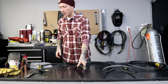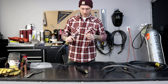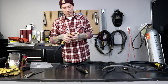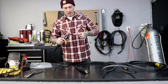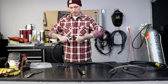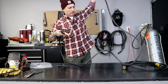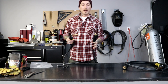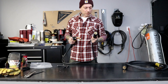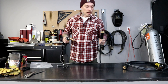We know ours fits already, so that's good. We've got our new liner. Now let's take our new 035 tip — that one threads all the way in nicely, good threads, good fit. Let's take our lovely new nozzle, spin it into position. And there we go — that's it. We've got ourselves a brand new Teflon liner in here, ready to go. Should weld nice and smooth. I'm going to have the guys in the back test it out this afternoon — they've got some MIG MMA 202s they're going to be working on. We'll run this up and make sure I did it right, but to be honest, I know I did it right because it's not that complicated.